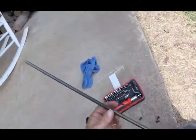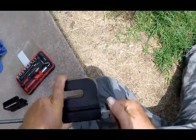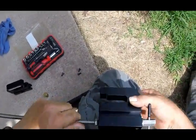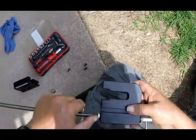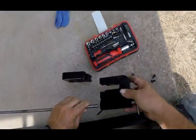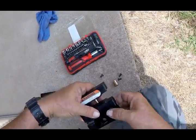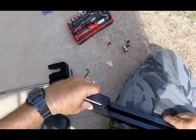Take a rag and clean this rod up real good. Now this back part here, there's not really much going on — you got a bushing and this just rotates inside this housing. So I'm not even going to take this nut off here and pull this out. But this part here, when it slides back in, you see those guides? You've got to line those up to get it to go back through this groove.